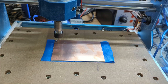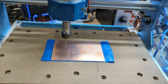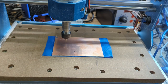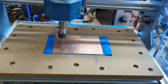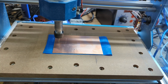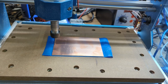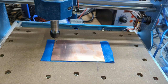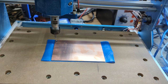So far it's not cutting. All this cutting is happening outside of where we're going to finally cut, so it doesn't even matter. Even at 0.01 offset, we're cutting into it a little bit. That tells me we need to go up even further — not knowing that I probably would have broken a bit.